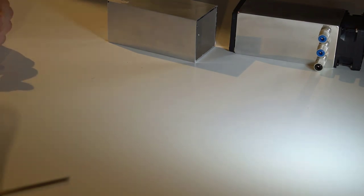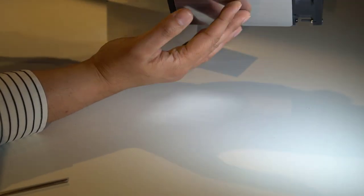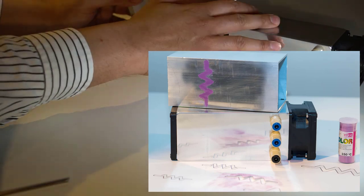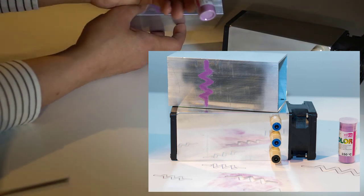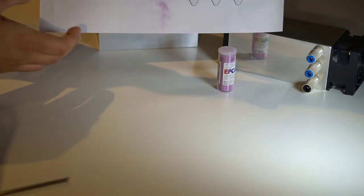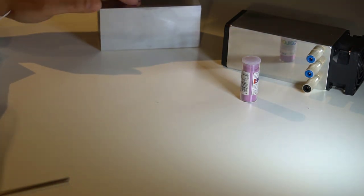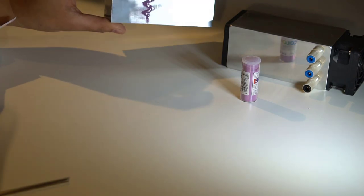As I mentioned, there's more information in the blog post. Actually, also another thing you could do is there's a lot of area here, so if you wanted to do some labeling and stuff on here, I found an interesting way of doing that was you could do something like this, which is just using enamel, but you've got to do this before you put everything inside it. And this is an afterthought, and I'm just kind of learning how to do this. But you can buy some enamel; it costs next to nothing. And cut out a shape and put it on top here, sprinkle the enamel on top of that, and then use a small candle inside here like a tea light, which heats this up, and then that makes the enamel bind to the metal. I didn't do a great job here, but this was my first attempt.